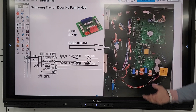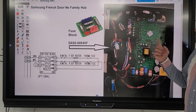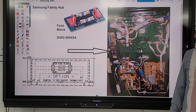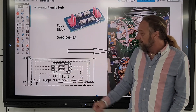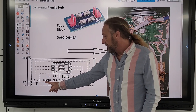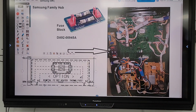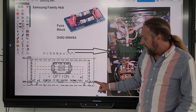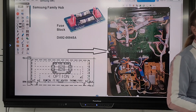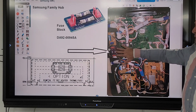I was trying to figure out what the purpose of that board was and what it does. I wanted to point out these fuses. The other refrigerator — the hub, a slightly bigger unit — only had two fuses. Power comes in, goes through the fuse, and comes back out to the heater. It looks like it goes up and right back down, and that's because one fuse is on each side of the heater. The board itself is in the back of the refrigerator, not near the heaters.